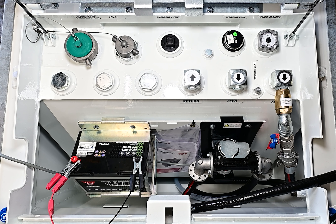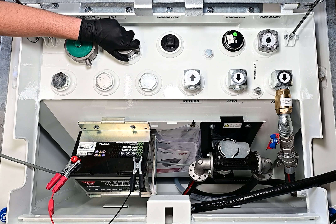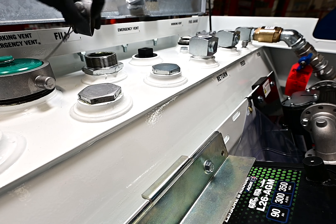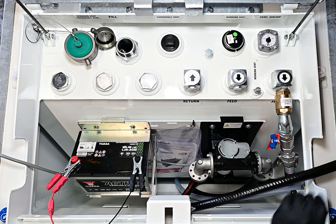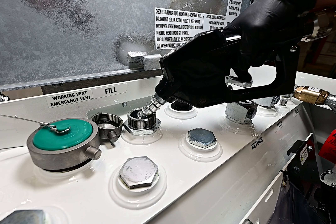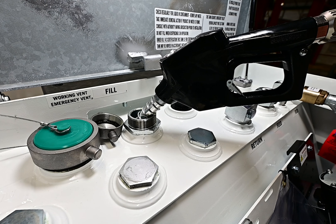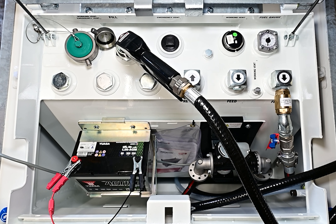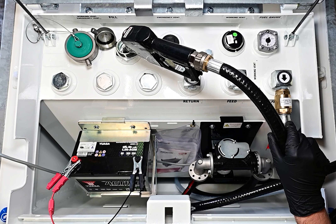To make sure you get fuel in the pump, just open the two inch port on the tank. Get the nozzle straight into the tank and put it into the open position. This will allow any air in the pump to go through the nozzle into the tank, and as soon as fuel starts going through it, it will go back into the tank, making sure you're not making a mess. So you don't necessarily need to have a vehicle nearby — you can use the tank to do the whole thing.